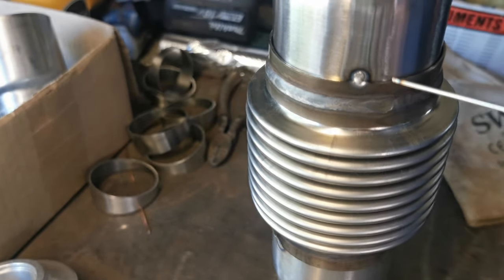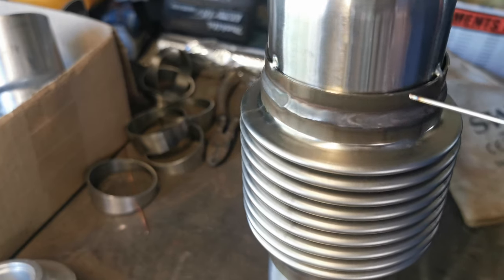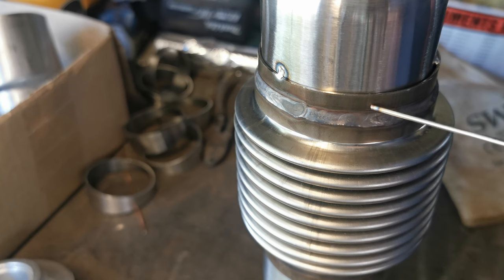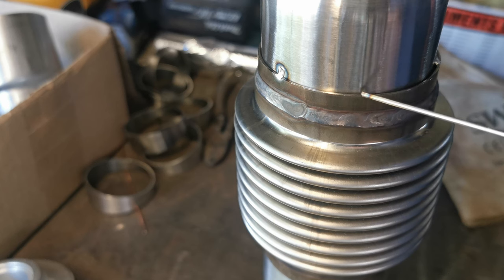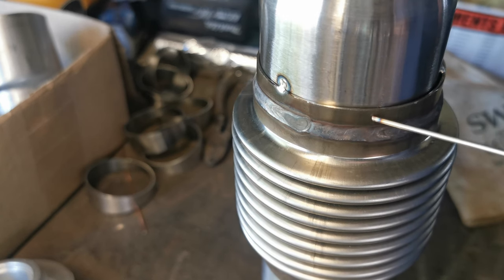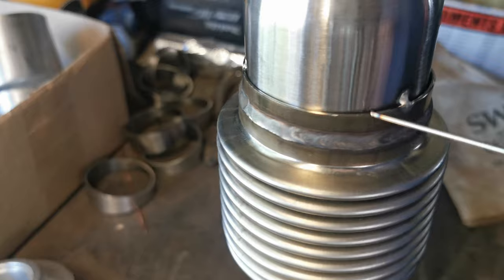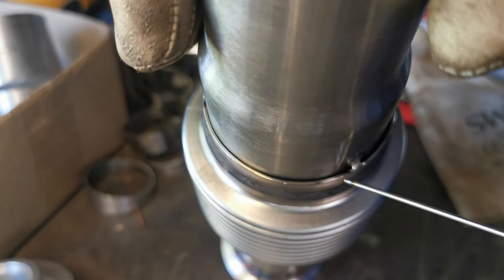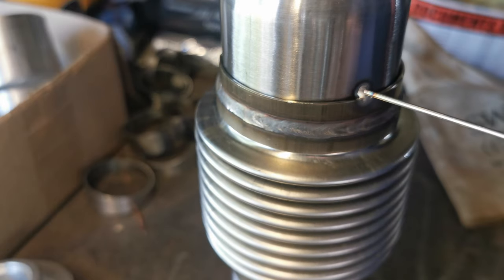This, on the other hand, seems to be much harder to weld. This is thin — it's pushed inside here, so it's thin. You need to heat this up quite a lot, but when you're welding right on an edge like that, when you catch it wrong it can just quickly melt away and disappear. So you've really got to be careful not to get it too hot. It's also not totally round, so you've got some bigger gaps — I'm just going to have to be careful with it.